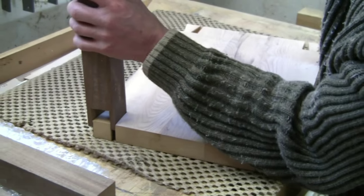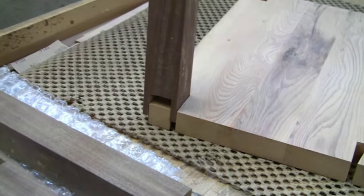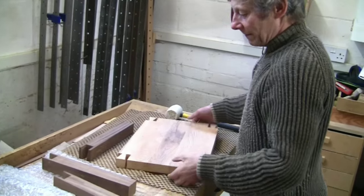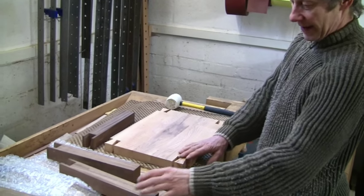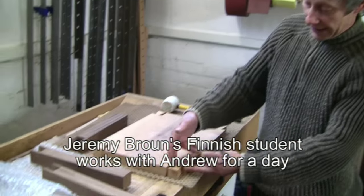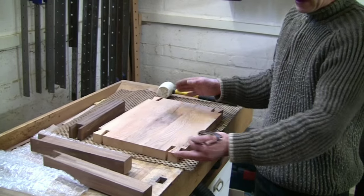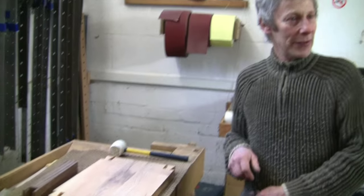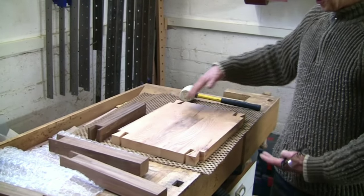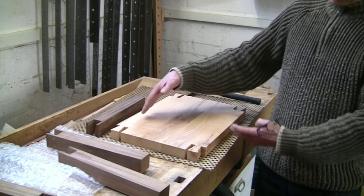That one's okay - you can see it goes in halfway by hand easily. I know that's going to enter all the way. I'll check each leg in turn and show you how to gently pare it back so you can assess whether it's too tight or not. Once we're certain the legs will all go in without excessive cramping force or any risk of splitting, we can then glue the legs onto the top in sequence, check squareness, and leave the glue to set.